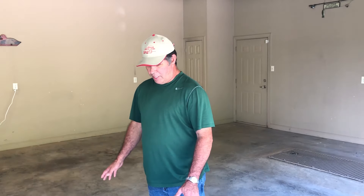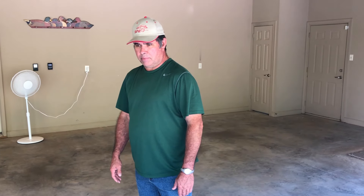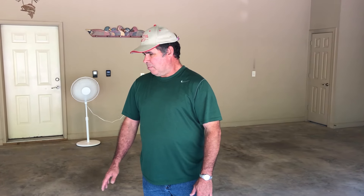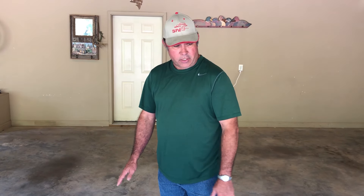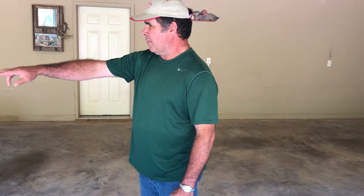This is the next day. We inspected and it's a dry day — everything looks to be dry and the texture feels good. Reading over customer feedback last night, some were concerned about using acid etch on brand-new concrete. They went ahead with a 60 grit pad where it was trialed out slicker than they wanted. The guy did mention there was a lot of dust that would come up and lay back down, so they ended up mopping after the grinding.